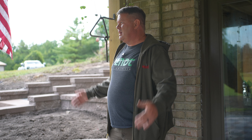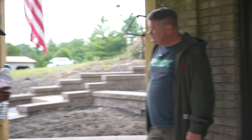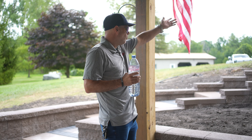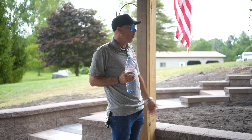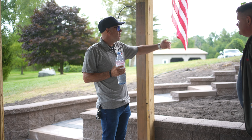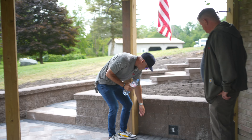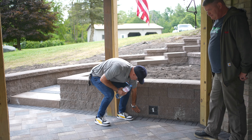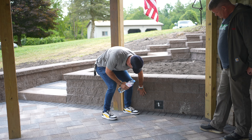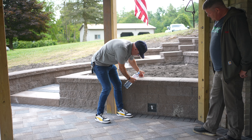He didn't put a drainage system in and had spent about $35,000. I had to give him a quote for $14,000 just to fix the wall and put the proper drainage in. That's the problem — the money people think they're saving. I'm standing here as a six-foot-tall man and that wall is going to be almost eight feet tall, so you've got eight feet of water pouring down this hill. Without drain tile behind it the water fills up, eventually the pressure pushes the wall over — basically creating a dam — and that's exactly what happened here.